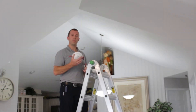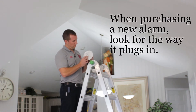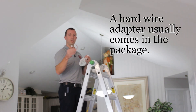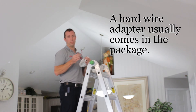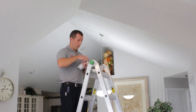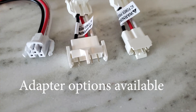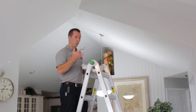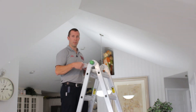When you're out looking for a new smoke detector, some things to look for are the way that it plugs in. Like we talked about earlier, we have several different adapters here. We have a hardwired adapter that comes in the package, and if you're comfortable with electrical work you can do this yourself and put in whatever plug it comes with. But if you're not, you have options like this. We have a wide three-prong that adapts to a triangular three-prong, and there are different codes for these — but that's the easiest way to explain it when you're at the store. There's also a narrow three that adapts to a triangular three. There are plenty of adapter options, and if we're going to help install this we'll need to have some sort of adapter or the proper connection to start with.